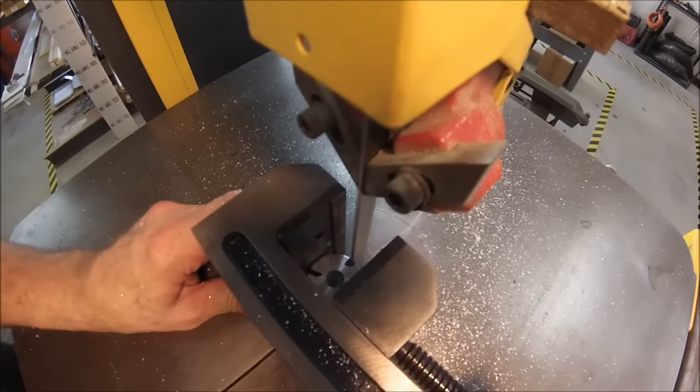I'm definitely getting resistance. I'm going to open up these slots just a little bit more — but don't open them up so far that when your finished diameter comes along you break through the web and the whole thing flies apart. I am about a sixteenth of an inch away now, and since this is a seven-sixteenths drill I just used, it'll be relatively close. Get back in there and squeeze down on it. You want your shim to protrude inside the drilled hole — that is okay and preferred. That is nice and tight. The bushing has closed up on the shim; the shim's not going anywhere front to rear. I'm going to pass the drill back through there just to knock the shim off.